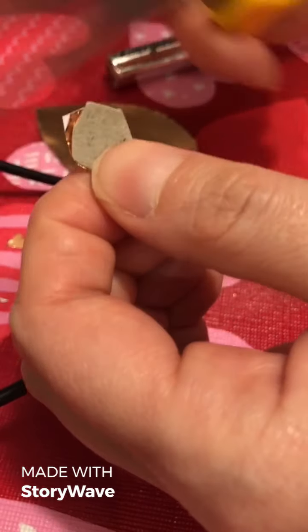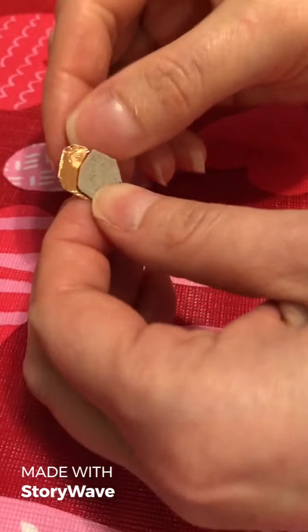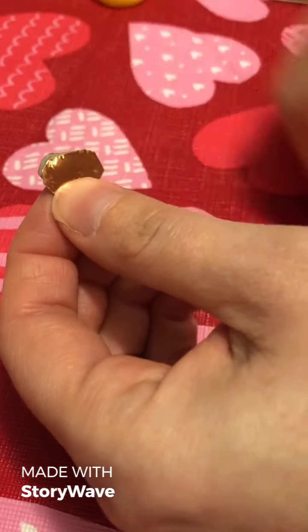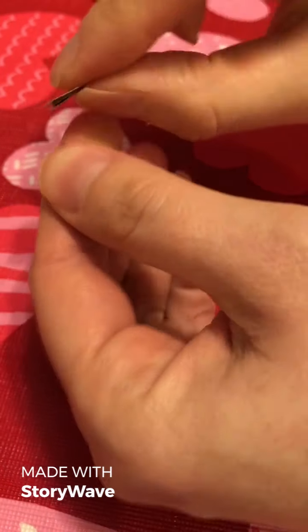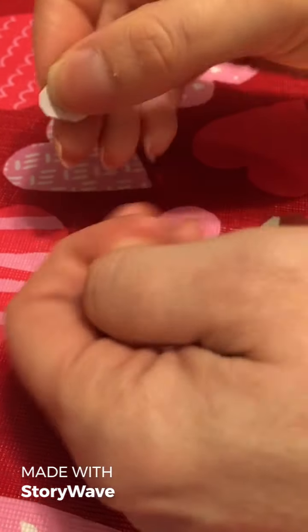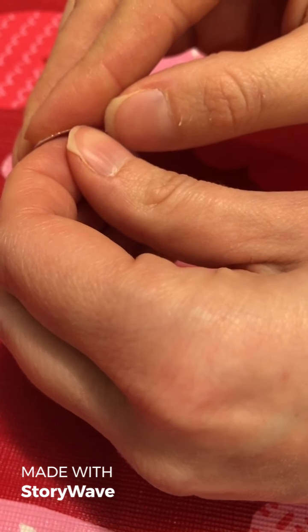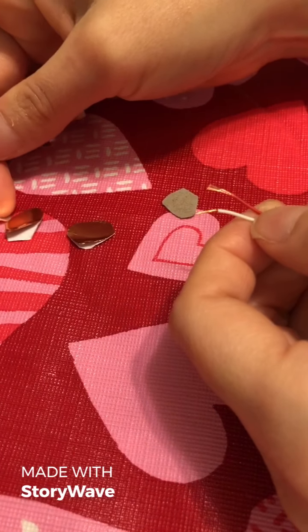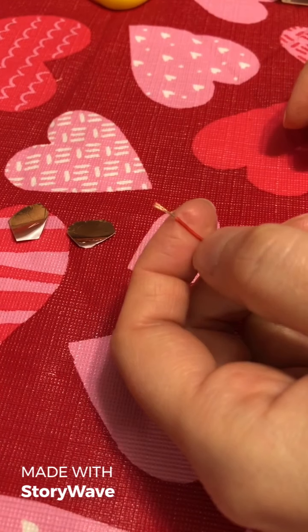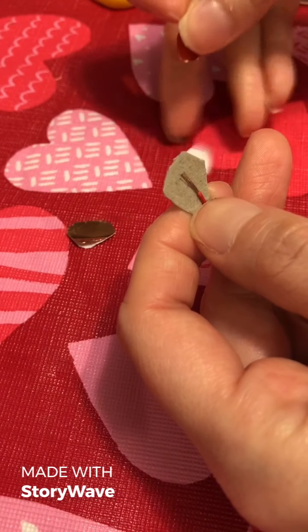I've got the male end of my 3.5 millimeter stereo cable — I used the female end in the Christmas tree video. So we need that. We need a pair of scissors, electrical tape, a little piece of cardboard or cardstock with a bit of thickness and stiffness. We need a metal file, because we're going to shave down some of the plastic in the battery pack so our battery interrupter can sit in there nicer. And we need copper sticky-back paper — I got two big sheets on Amazon for nine bucks and you can make a bazillion battery interrupters out of this.